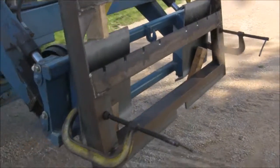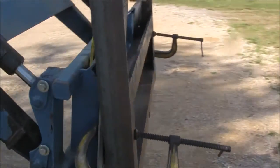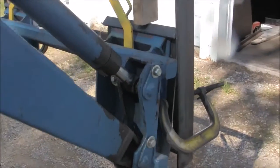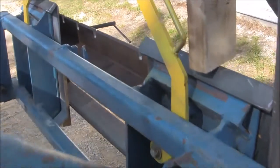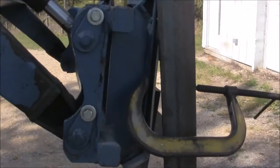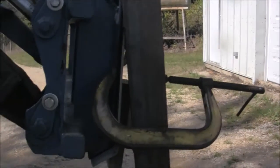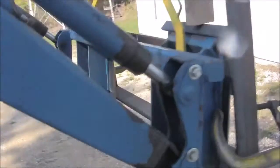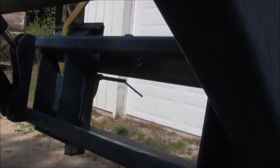And now we've put it on the tractor, and we've jostled it around until everything's symmetrical and the 2x4s are in place to hold the spacings, and we'll tack it right here on the tractor, and that way we know that it'll fit when we're all done. And I'll take my tape measure and I'll go over it one more time just to be sure.